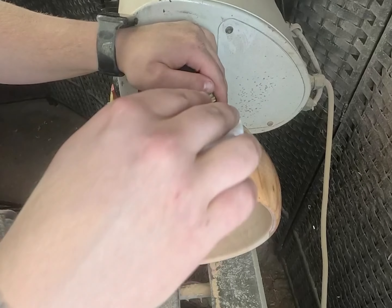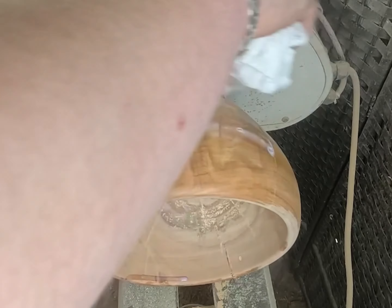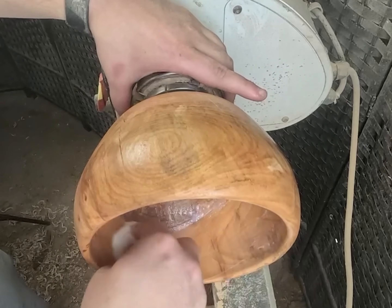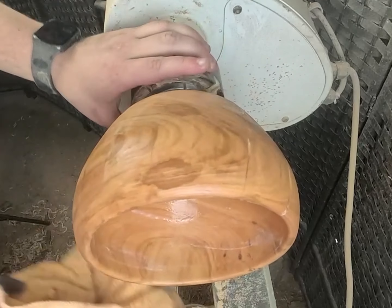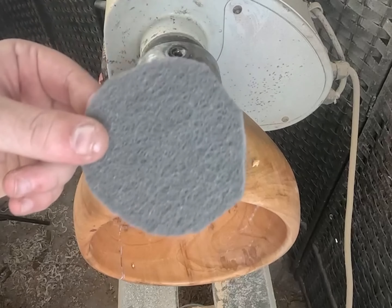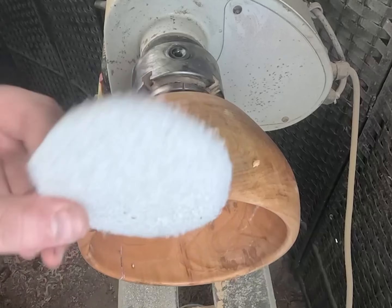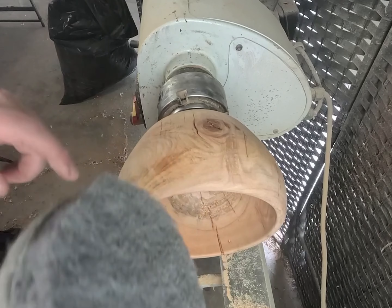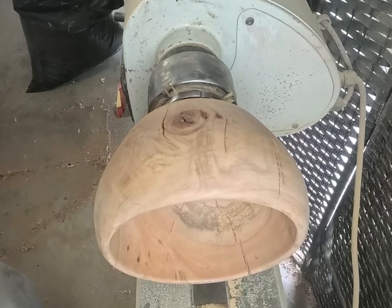This gives us a pretty good idea of what the finished product is going to look like. Okay, first coat is on — now we're just going to wipe off the extra bits with a towel and wait about 10 or 15 minutes for it to dry. When it's dry we'll be buffing it with this abrasive pad, put on another coat, use the abrasive pad again, and then after the third coat we're going to be using this white abrasive pad. It's been 10 minutes, all dry — it's not very smooth, that's why we're using this pad. All right, time for the second coat.